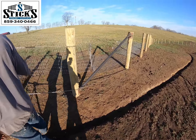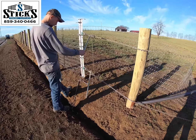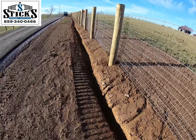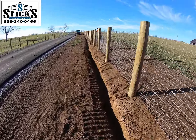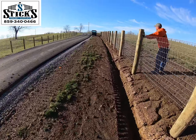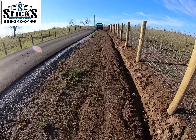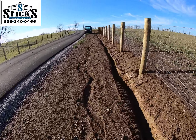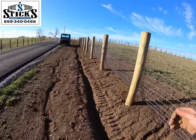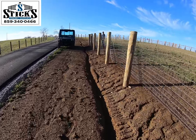So we've got just a little bit of tension on our fence — it ain't very much. We're going to walk back up here to the curve and we're going to communicate back to the guy on the stretcher bar to pull until our staples move, or until we feel like our fence is tight enough around our curve. Then what we'll do is come back up to the curve and push in to the posts that are not stapled.